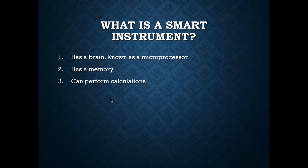To calculate flow we use a square root extractor. One thing to be cautious of: these smart transmitters can do the square rooting, and then your DCS can also do that square rooting — you have to be careful to do it only once. Different companies have different protocols for where square root extraction happens — transmitter or DCS — but you can only do it once or your readings will be wrong.